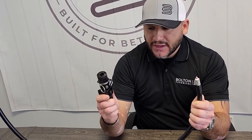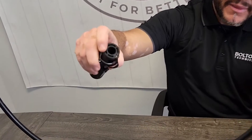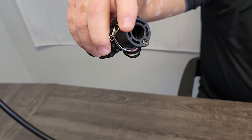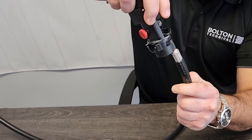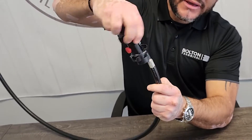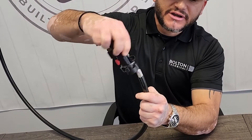The one last step for the prep is also on the LMR 600 prep tool — there is a groove here that is going to go over the center conductor. This will prep the center conductor for the pin that goes over it. I'm going to apply this like so and just twist — that's going to lacerate the center conductor and prep it for my center conductor connector.